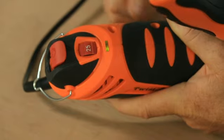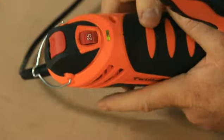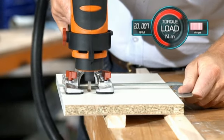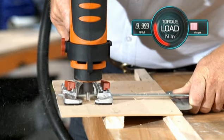There are unique safety features built into the Twister Saw. If it overheats, the green indicator light turns red and it automatically shuts down — simply turn it off and let it cool before restarting. If there is a power interruption or the switch is in the on position when starting, it will not start for safety; turn it off and back on to use. The advanced torque control automatically adjusts to keep speed constant under load.